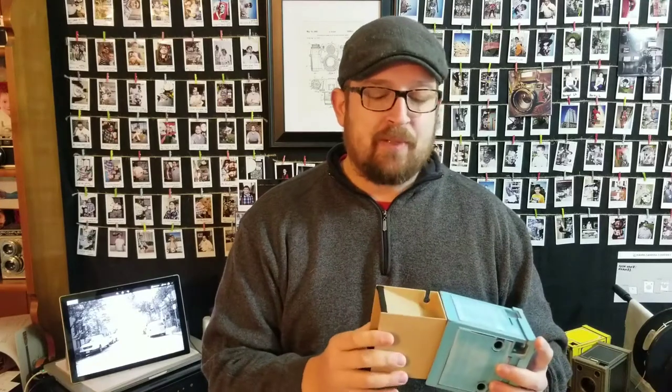Something very important about a camera is the ground glass test. Using a single element meniscus lens means we're able to do something really special to tell if we've got our focus right. We go ahead and place the box in the camera like this, take a piece of ground glass and put it right there, put a coif or a loupe over our head, and then look to see if we get an image — albeit reversed and upside down — in the rear view. And we do.